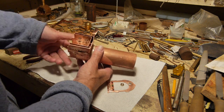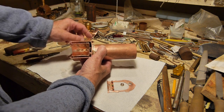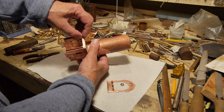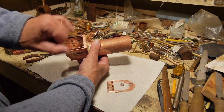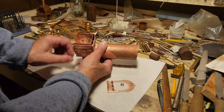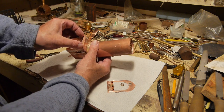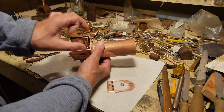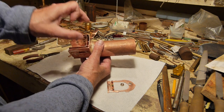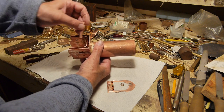What I'm going to do now is put in the foundation ring — that's the ring that goes around here. This has to be very carefully made because I want it to be a close fit so the solder goes properly into the joint. I've very carefully cut, taking my time over it, making these pieces of copper suitable for the gap that's there. The gap here you'll see is slightly bowed, and I did that because it was a little bit wide for the frames and the only choice I had was to squeeze it in a little bit, which caused that bow — no problem at all. I did that before I put the stays in the inner firebox.